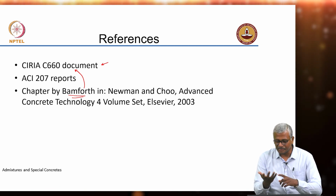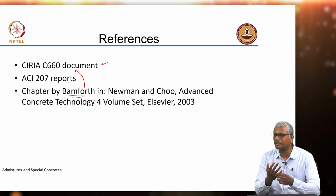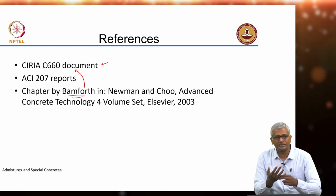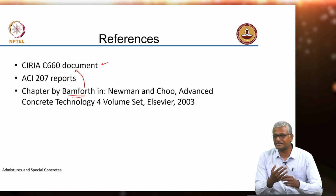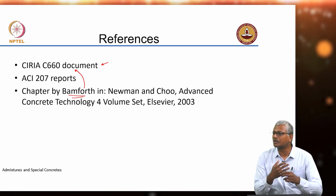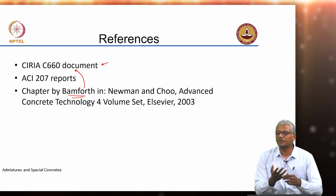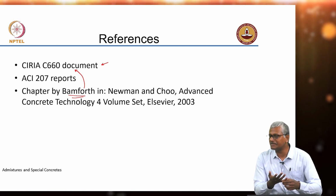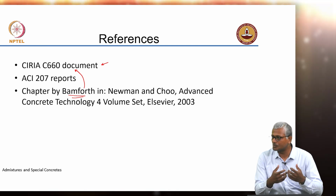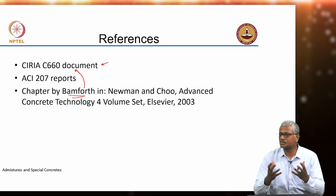Okay. So, as I said, contradictory demands are made from the concrete. You need very high workability. For extremely high workability, you need to increase cementitious content. When you increase cementitious content, it increases the heat. When you place restrictions on what type of binder can be used and not allow fly ash, that heat is going to be developed even more. As you increase the grade of the concrete, you further increase the heat. There is not sufficient amount of water to take the heat, right? If you have less water, the heat rises much faster, right? All of this has to be looked at very carefully.